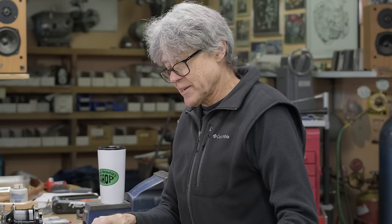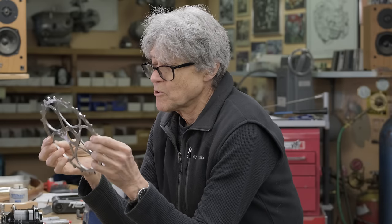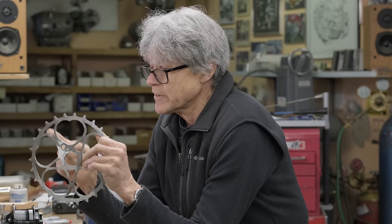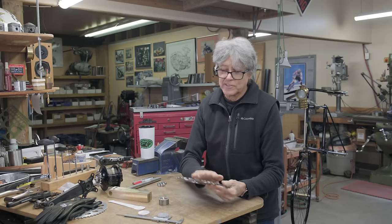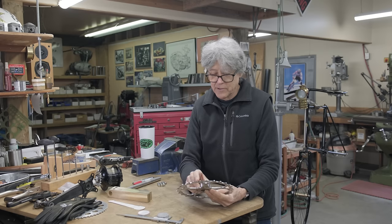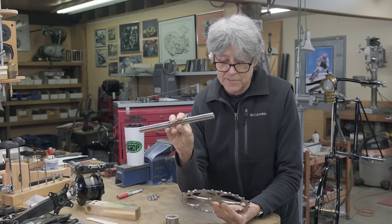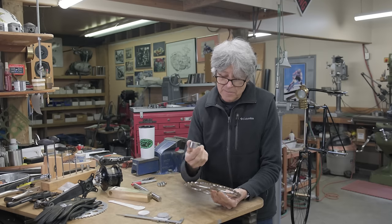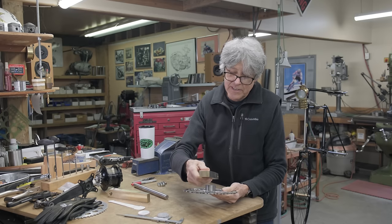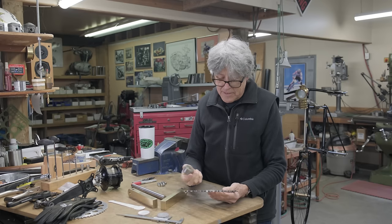All right, we've got a chain ring here. Yesterday I was outside, it was not super warm, and I took a grinder, well, actually a belt sander, and a spiral roll on a quarter inch grinder, and I took off the chrome because we need to do some work here. We have to put in a bushing here, I'll call it a bushing, and that's what goes onto the shaft, a 3/4 inch shaft made out of stainless steel. So this is going to be silver soldered on, and there also has to be something going here because that has to locate onto the crank arm. I don't have the taps yet, that's why we haven't finished off this, but this is going to be a day's work here.